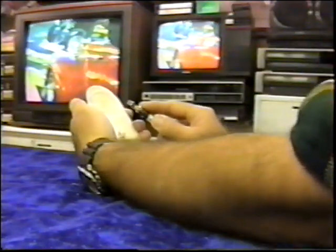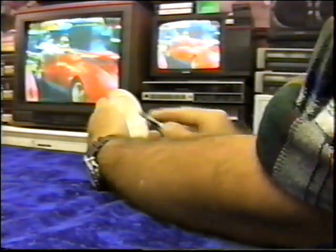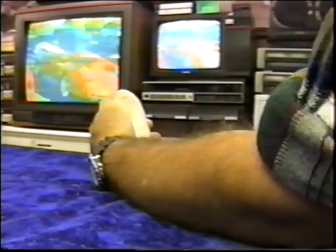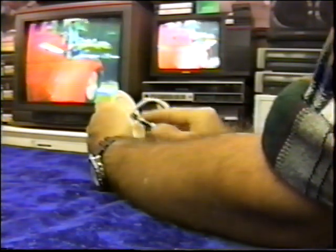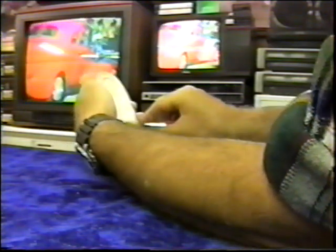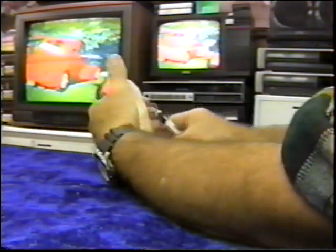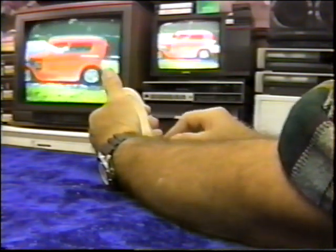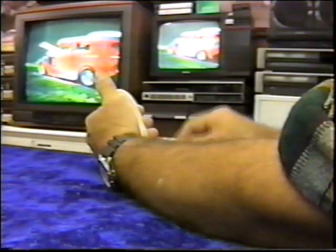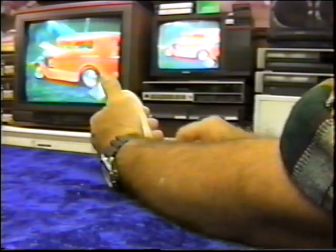Now it seems like, and this is just a good point, it seems like these blades have about the life expectancy of carving one top block, no matter how punky the wood is. They don't really last indefinitely. Like number 11s and 26s, you can resharpen up to a point, but these don't seem that way. So the thought is, if you're going to order a couple of packs of blades, buy extra ones if you're going to do carving and hollowing to any degree.